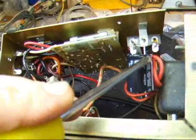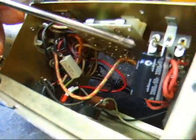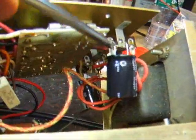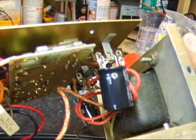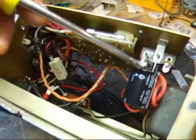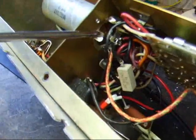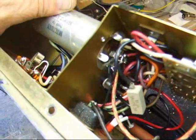You can see the minus here on the stripe — our capacitor is going to ground, and the positive side, which is not marked, is going to the positive of the bridge rectifier. Again, the reason we put the capacitor here is because of the room involved; it's very difficult to get the component in otherwise.